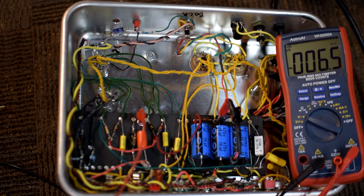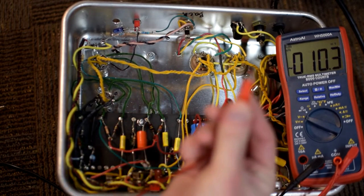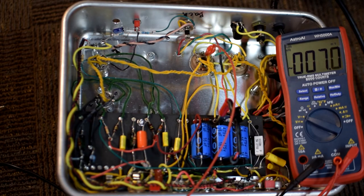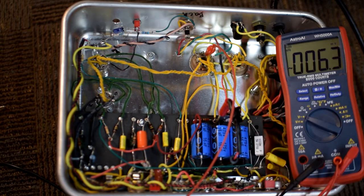And even if you're going to take voltages, there's no reason why you couldn't get two of these alligator clips, clip one to ground and clip the other one where you want it, then turn your amp on, let it warm up, take your voltage. You're not even sticking your hands into the chassis. There's no concern using that kind of method.